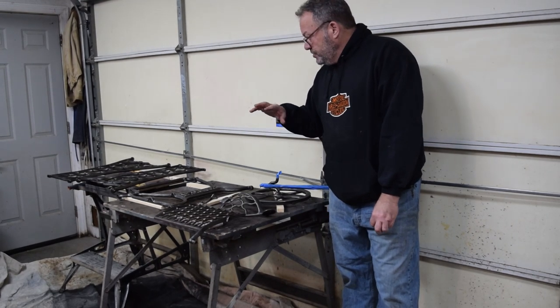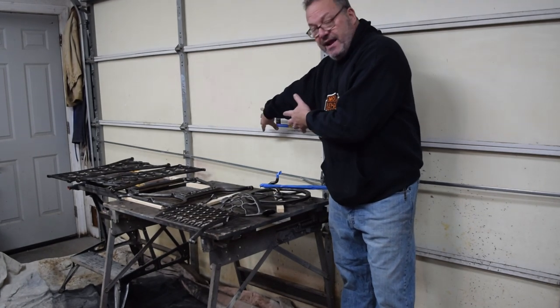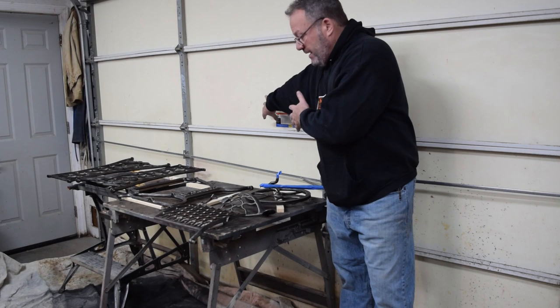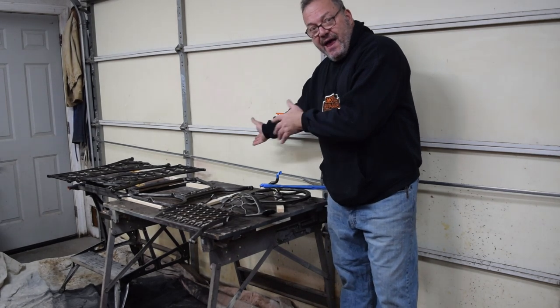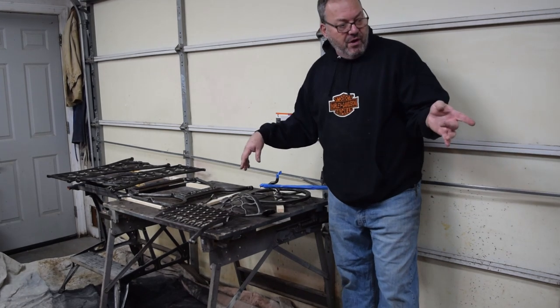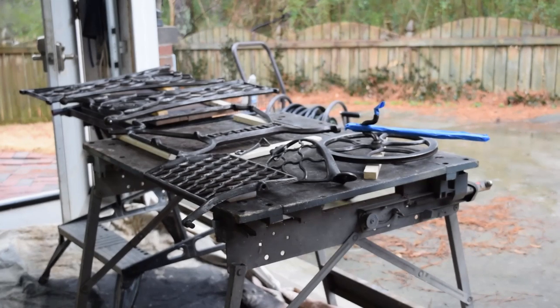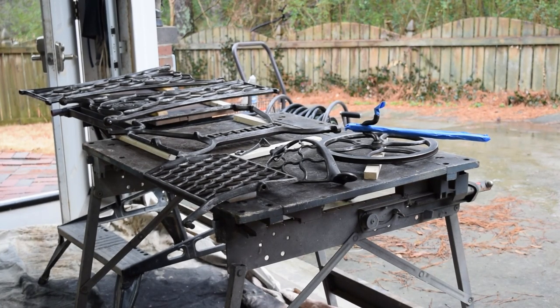So what we're going to do is open the garage door. I'll shoot the paint actually just inside the shop here. The paint will blow out this way, and then we'll drag it back inside, turn on the heat, let it dry, flip them over, and do it again. I'm using Rust-Oleum Ultra Cover Semi-Gloss Black. Okay, let's give it a whirl.